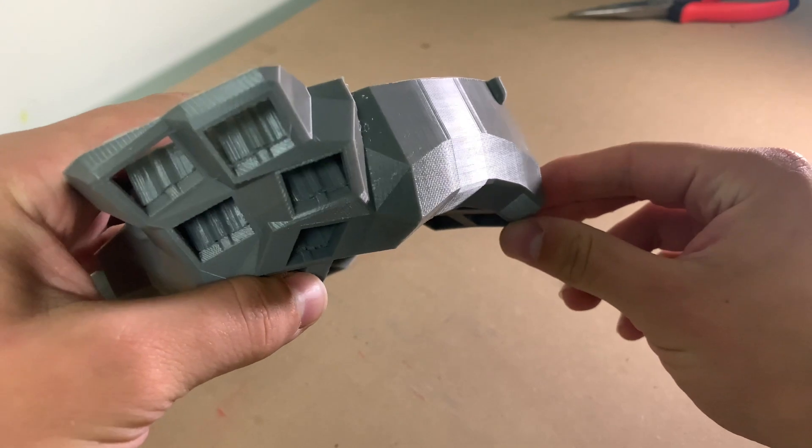Epoxy is a dangerous thing but let's see how we go. I've already glued in the USB port — it's equal parts mixture A and mixture B. Mix them together and you should get about two to three minutes of working time at 20 degrees Celsius, which is pretty much exactly what it is right now.